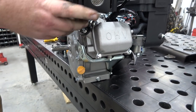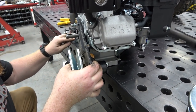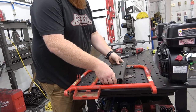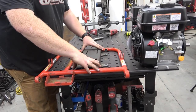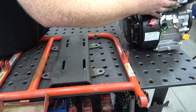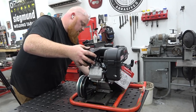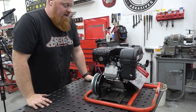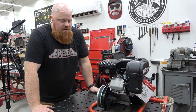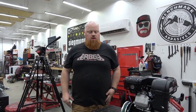Again, checking to make sure it's tight. This is just an old engine plate I have for testing engines. So, it does look like we're gonna be okay. We're gonna go ahead and add 2.5-3 inches to the length just to be on the safe side, and that will kick its wheelbase out a little bit. That'll also make the go-kart a little bit more stable.